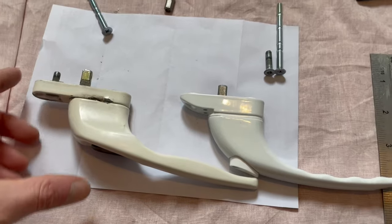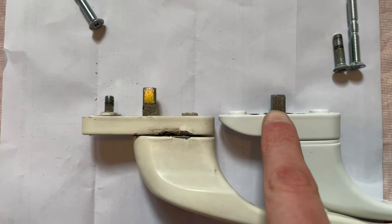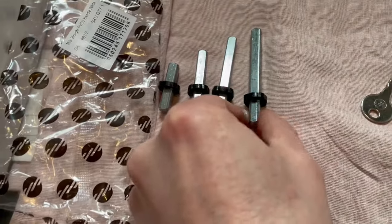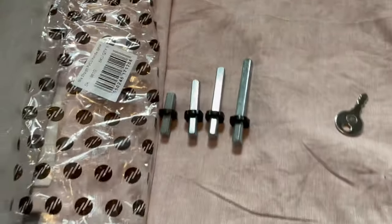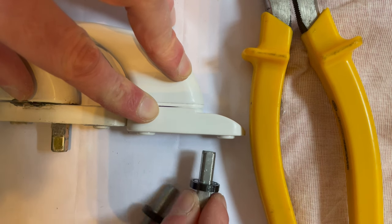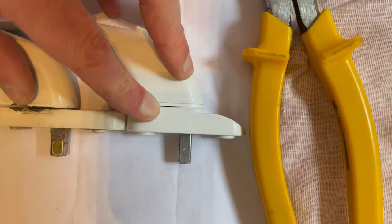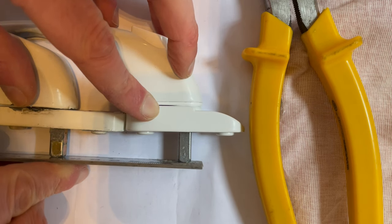With the two handles side by side, if we slide the old one across to the new one, I'm just going to check the spindle length. You can see that this old spindle is a little bit longer than the one that's inserted here. Fortunately we've got some extra spindles we can replace this with. If you chose a handle that didn't come with extra spindles, it will normally come with a longer one, perhaps 40mm, and you'll have to cut it down with the hacksaw. I'm going to take this spindle out because it's too short and replace it with the one that came in the pack. Just inserting that there, then we line these back up and double-check they're around about the same size - and you can see they're pretty much the same. Now we can insert it.